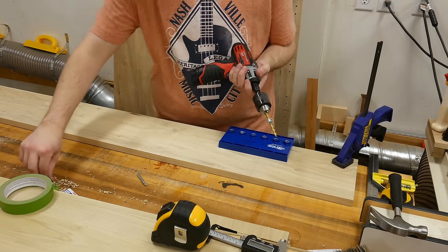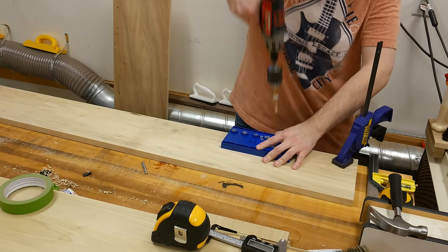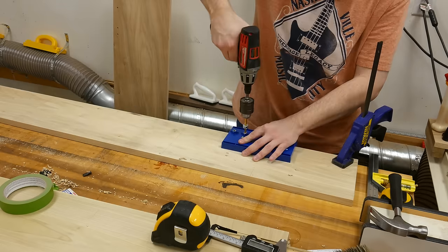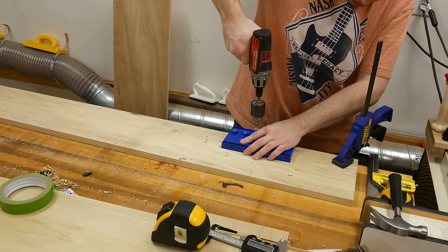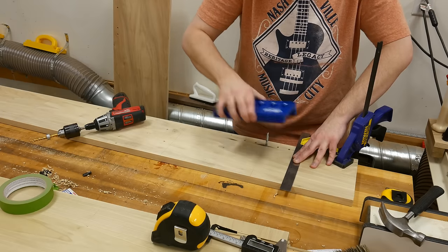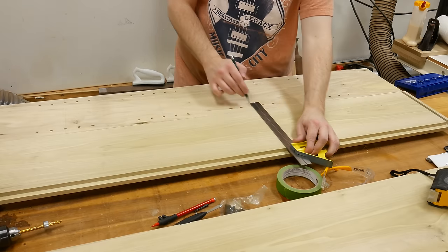This is probably the second most tedious part of the project — drilling out the holes for the shelf pins. I'm using quarter-inch shelf pins with a quarter-inch drill bit and a depth collar to stop it at the perfect size. To keep everything lined up, I laid the two vertical dividers side by side, drew center lines so they reference each other, then put the vertical left and right walls of the cabinet case next to them and struck a line to make sure all four vertical walls had the exact same hole lineup.